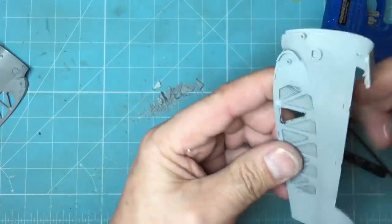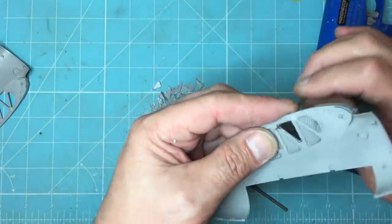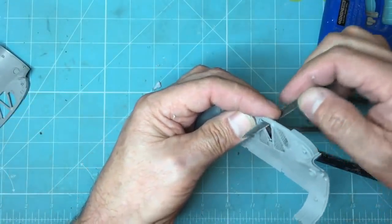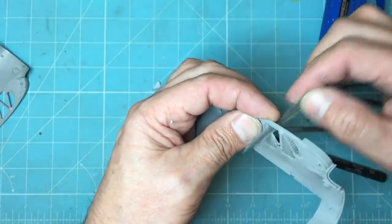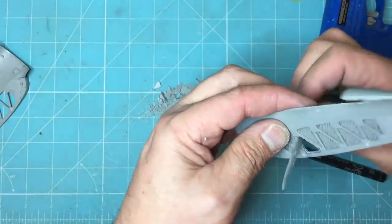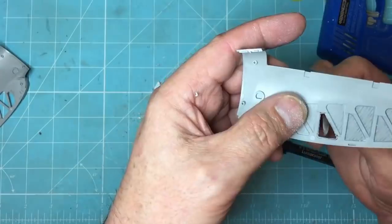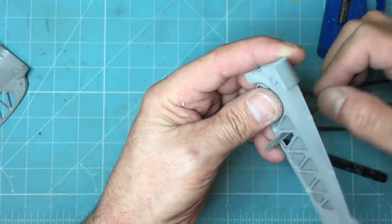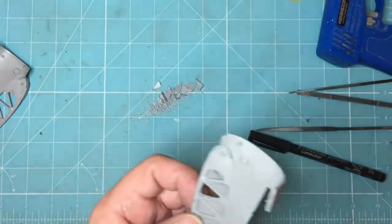If I can stay in. Stay inside and keep all the black there, using the round file now to get into that radius corner, and then again with the flat file, but staying away from that radius. So I put my finger behind and it stops me running into that. You don't want to run into that radius and put a groove in it. Just file up into those corners. And then when we're all pretty close, we can just try and make sure that everything stays nice and square. And as you can see on that bottom edge, I'm getting very close.